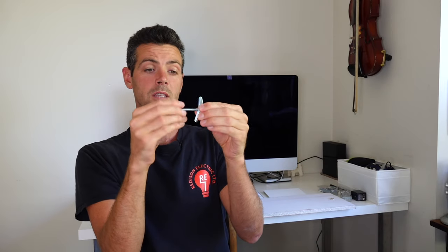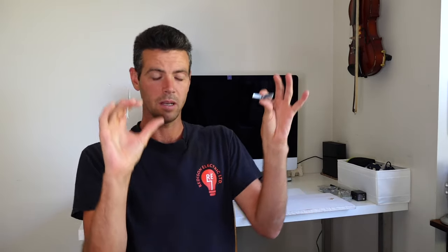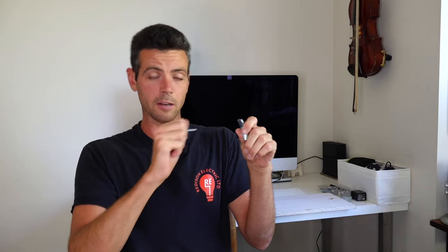To cover some of the downsides: the big hole you have to make needs to get covered by something. The second thing is if you ever pull these out — say you have to take it off — you lose the toggle in the wall, so you'll need new toggle bolts to do it over again. But the plus sides are way better holding than cheap anchors, and you get all that adjustment before you fully and firmly anchor it.